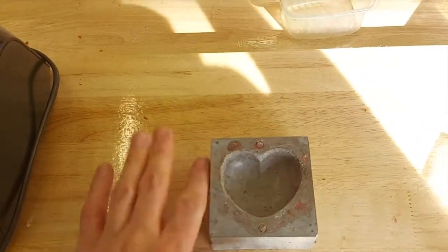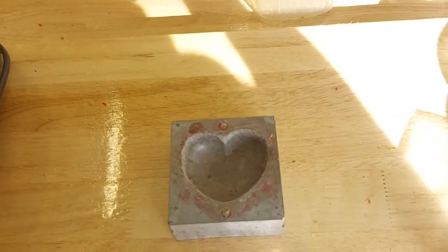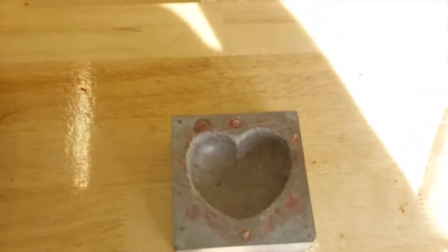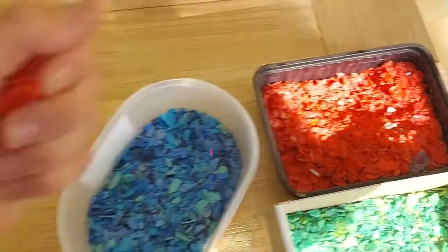This one I polished a little bit afterwards and I painted it with some sealer — just PVA glue sealer. Once I had done that, I was then able to take my plastic and put it into my mould.